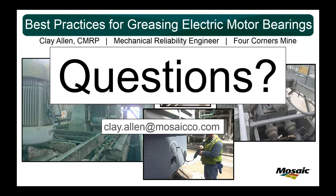It's also going to tell me on the left where it stacks your readings. You're going to have basically two readings that are exactly the same, but the times are going to be a couple seconds off. That's how I know I added 0 shots, and it's every 3 months. Now keep in mind that our PdM vendor does monthly checks on all of our equipment. So if they see something from a vibration perspective in between those 3 months, they'll let me know, and I'll grab the ultrasound, go out there and listen to it.